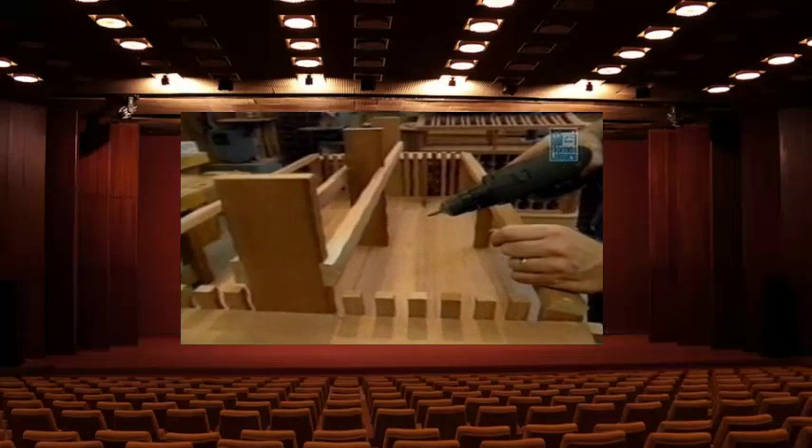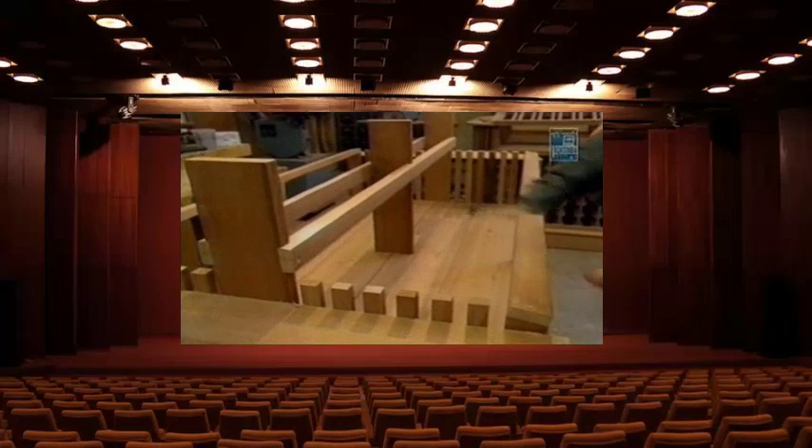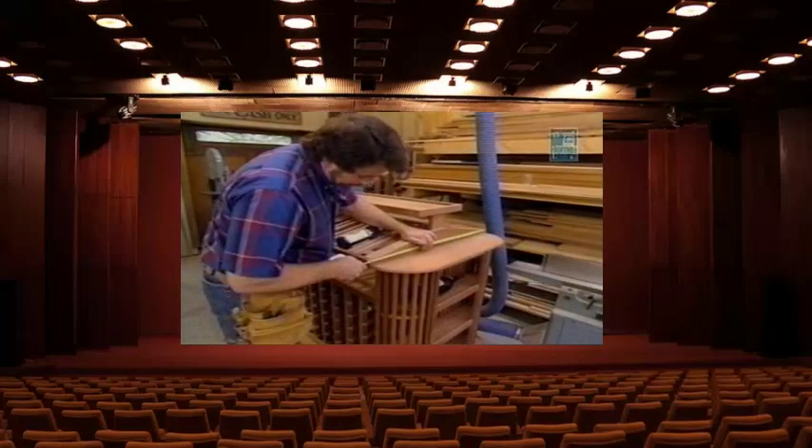There are four support cleats that hold the display rack. The ones that meet the center standard are slightly beveled at 12 and a half degrees, and the ones that meet the short standards are just cut square. For the last few minutes I've been laying out this triangular piece of redwood which is the end cap for the display rack.